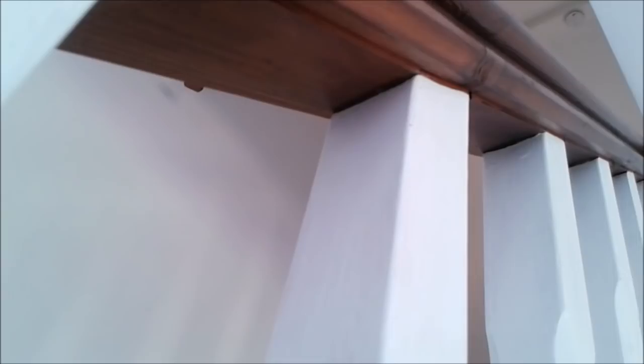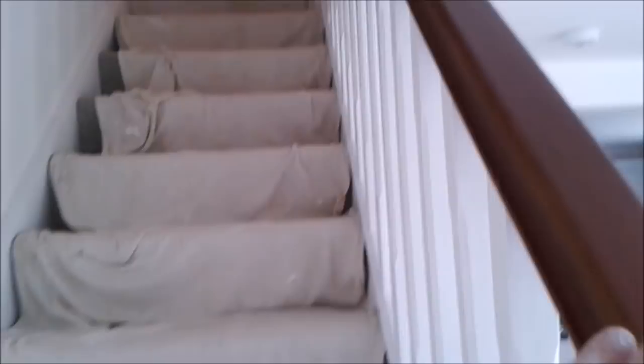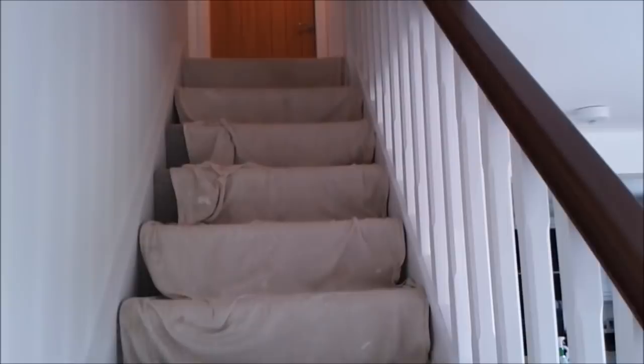I actually painted this from when it was installed — it's all new wood. I started with the handrail first, staining and finishing it. This is pine, so all the knots were sealed, then it was undercoated and had two coats of satin wood. Now it's just having another coat of satin wood to brighten it up; the handrail doesn't need doing.